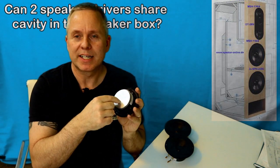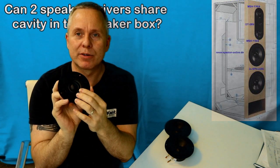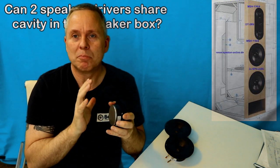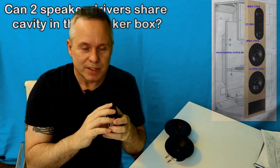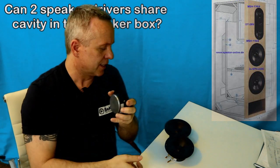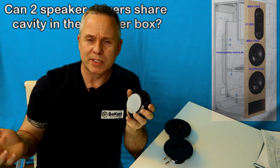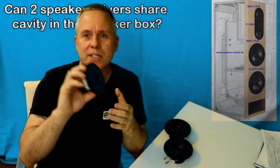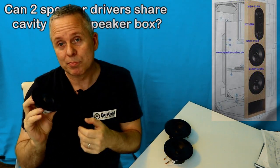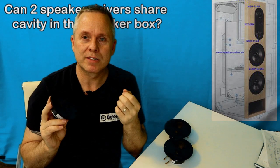If it in fact has a hole in the back — open in some way or form where it has access to the membrane in the front — you will need some kind of dividing box for it. The important thing to understand is that you don't want a giant speaker driver producing a lot of pressure inside the box that's going to end up pushing the little drivers way in and out, which would produce a lot of distortion. It would sound pretty bad.